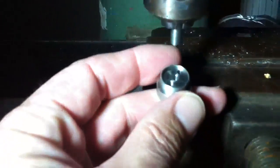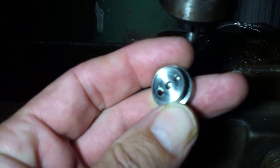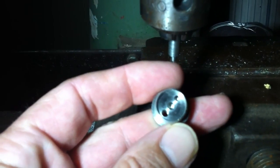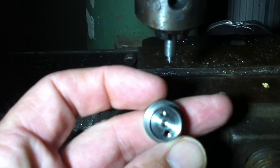This is the base right here that you'd receive. One side is threaded, as you can see on the left side. The other side is a .092 hole that's one-eighth of an inch deep. That's where our threaded insert is going to go into.